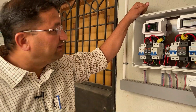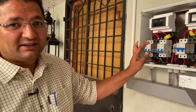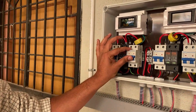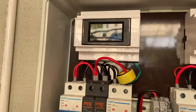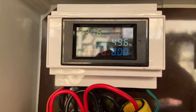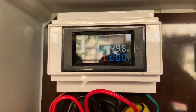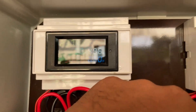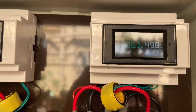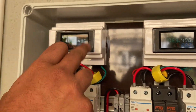We are back here at the inverter. The grid power is by default kept off. We can switch it on — and really nothing happens because there is enough solar power available. A meter is there to measure the grid input parameters. Now the grid is on but there is enough solar power, so the input taken from the grid is 0, the voltage drawn is 0, the current drawn is 0. Though the input voltage from the grid is about 237 volts, the output is 218 volts — the inverter conditions the power so that the output voltage is maintained. The two are actually isolated because nothing is being drawn from the grid.